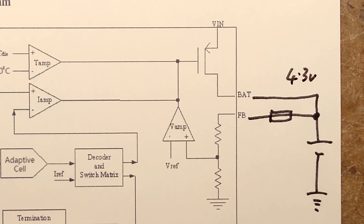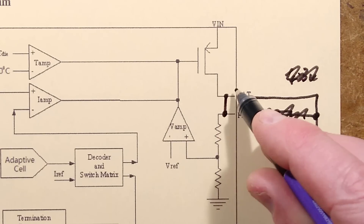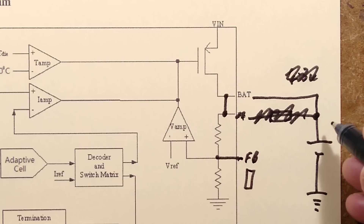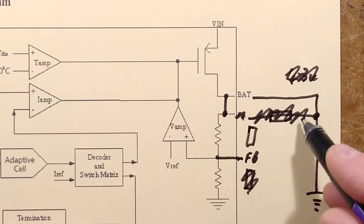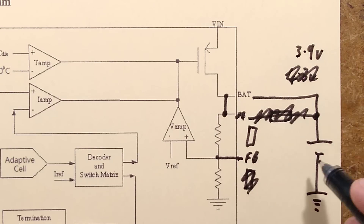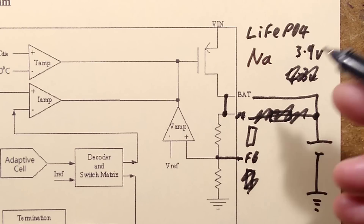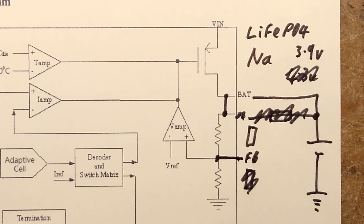But to me that's not a great idea, because what they could have done is bring the tap out to a feedback pin. With that, a resistor could tune it to increase or decrease the voltage - say, charge to 3.9 volts for long-term storage to prolong cell life, or match it to lithium iron phosphate (LiFePO4) termination voltage, or even the new sodium cells coming out - just change one resistor. That seems a bit of a shame; maybe they'll see this video and consider it for a new version. But other than that, it's quite an interesting chip, nice that it's optimised for solar panel charging.